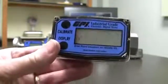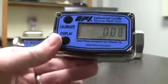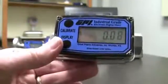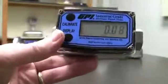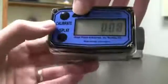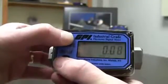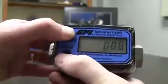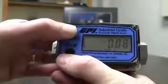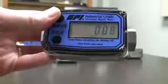So in this case I'm not going to do another run — I'm just going to go ahead and hold down both buttons and not let go until it says Cal End. Once that's done, this meter has got a new calibration in it. As long as I leave it on that calibration, it will read at that new calibration. It's always a good idea to test that — empty out the bucket, fill it back up again, and see if it gives you five gallons. To switch back and forth, hold down calibrate: gallons preset goes back to factory calibration for water. Liters preset, then Cal B, then Cal C — which is the one I did the calibration on. So any time we're doing glycol or antifreeze in this particular meter, we'd be on calibration C and it should read just fine. And that's about it on calibrations — pretty simple. If you ever have trouble, don't hesitate to give us a call at the factory. Thanks a lot.